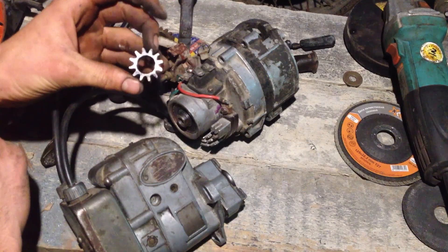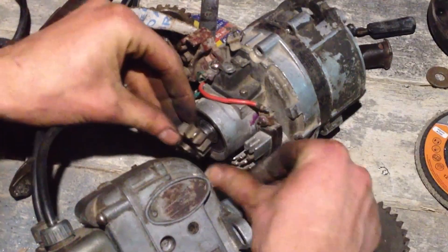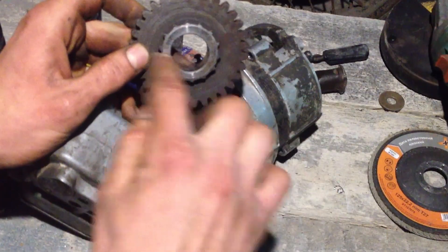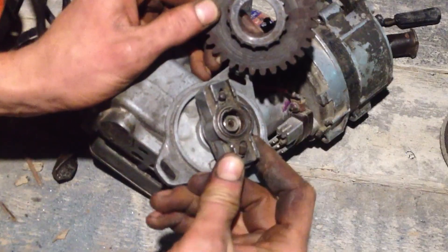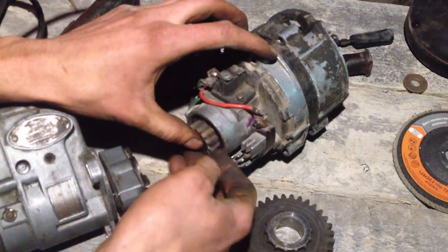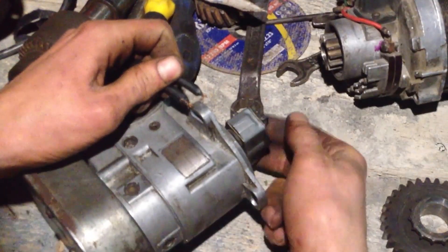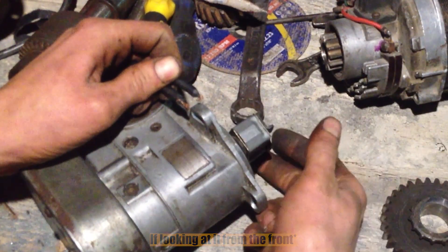I made this gear and thought that it was fine and everything would work out. But as always, several problems appeared. This gear was supposed to go here. This one from a Dnipro gearbox — I was thinking of cutting it so there's one big spline here that would go here, because here we have the ignition advance. Then I wanted to put some kind of mount with a bearing and axle here, and this gear would sit on this mount. Now about the problems: the generator rotates counterclockwise, accordingly this thing would rotate clockwise. But this particular magneto is right-handed — it needs to be turned clockwise to produce spark.